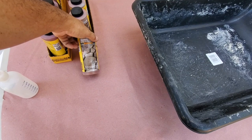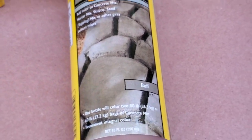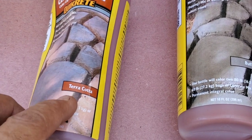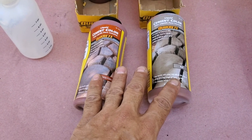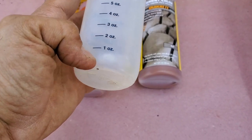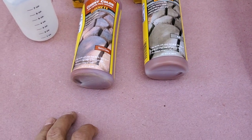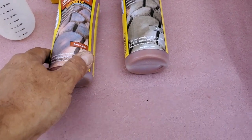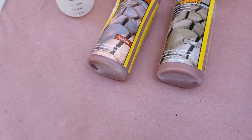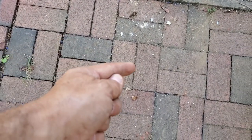I have the tint. This one is called buff — buff tint. It's like a grayish, brownish, more gray than anything. And then this is terracotta. So I don't want so much reddish, so I figured I'll mix them. I have 80 pound bags of concrete and I'm going to put — it's by ounces. One ounce treats 20 pounds of concrete, so I'll put four ounces for the 80 pounds. My mixture: I'm going to try two ounces terracotta, two ounces buff, and we'll see how it looks. What I'm looking for is a color where you see red, gray, red, gray. So some of them I'll make all that buff color and the others I'll mix it — a lighter terracotta.